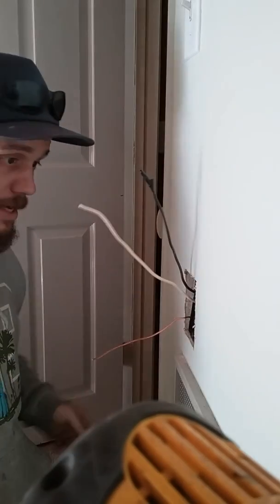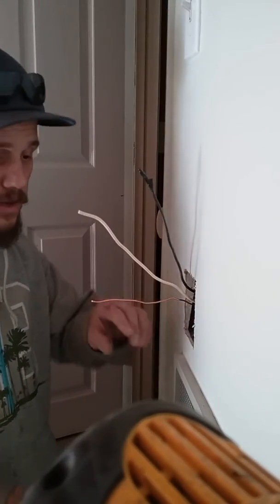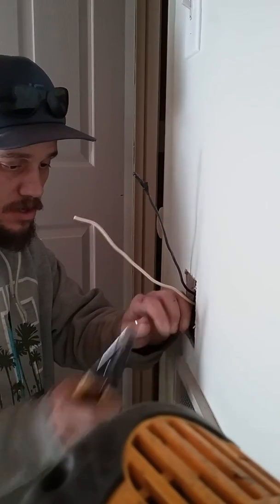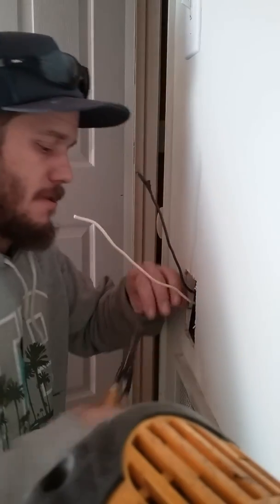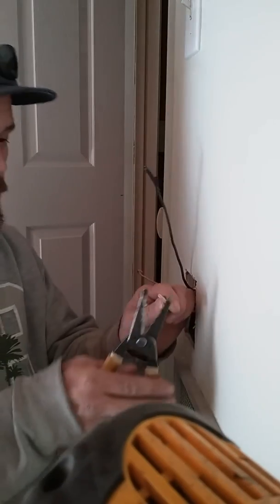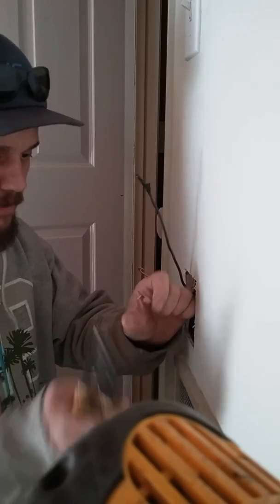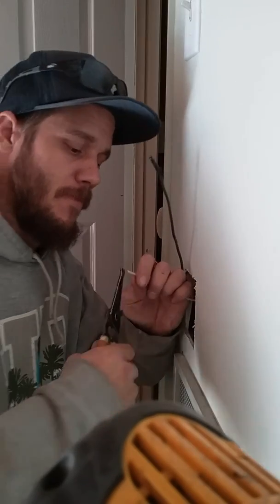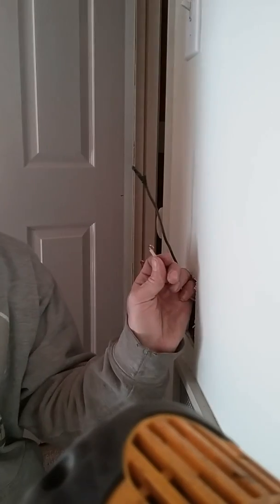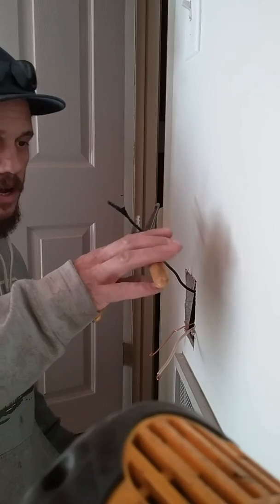Neutral wire — bam. And ground wire. I moved these out of the heater up into the wall. Don't need as much length. I'm gonna take the ground, put a loop. Take the neutral — don't need that long, that much is good. Pop it — boom. See that? Okay, now push these down out of the way and cut the hot.